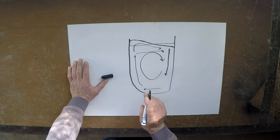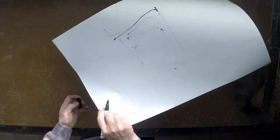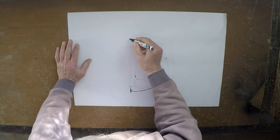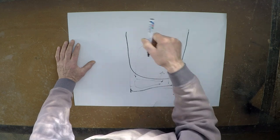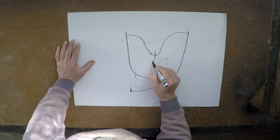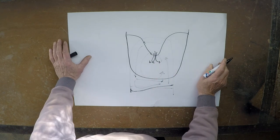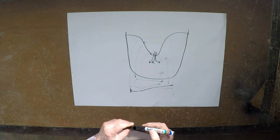That's what we're after. We do not want to beat around and around like this. If you go around and around like this, what will happen is your metal will do this — you will get a whirlpool. Whirlpools push air in. It may well mix the metal up reasonably well, but you're going to get a lot of air in when doing it.